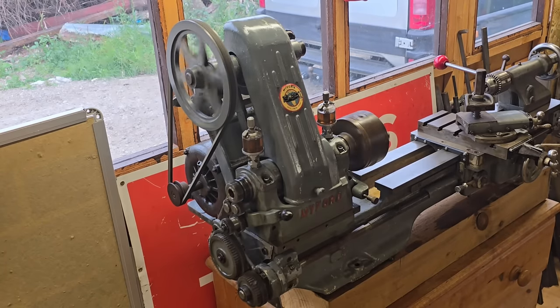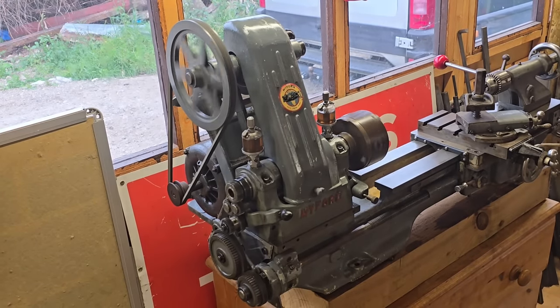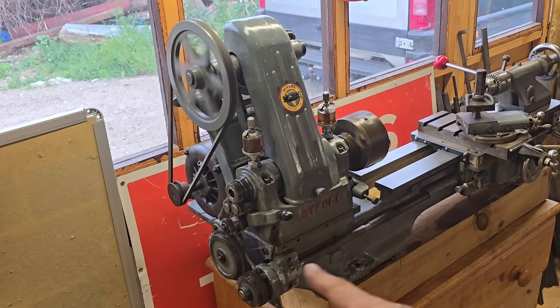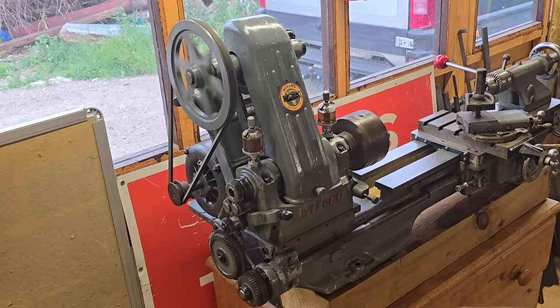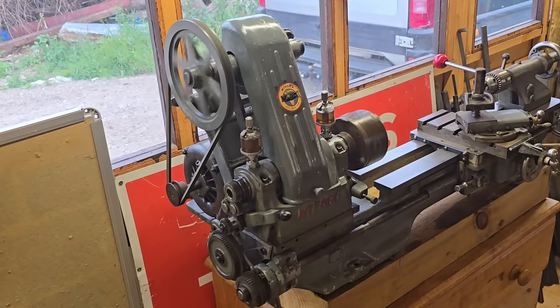We are working. So, she's doing something. We have gears. We have things on the move. I do have the covers for this end. I did clean all them gears up with a little brass brush and some diesel, and then thoroughly lubricated them. The white metal bearings in here are oiled. So, grease pins are oiled.